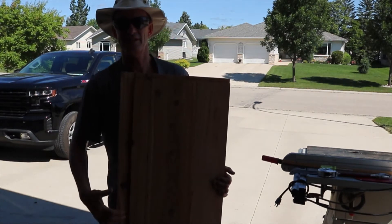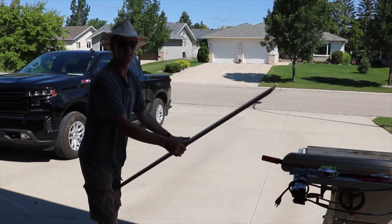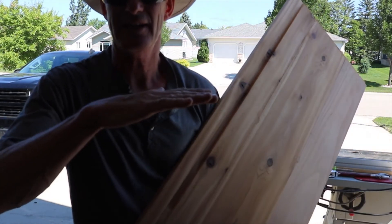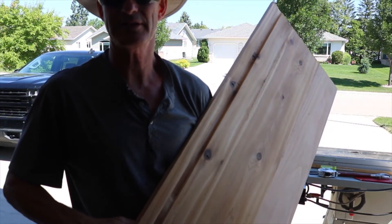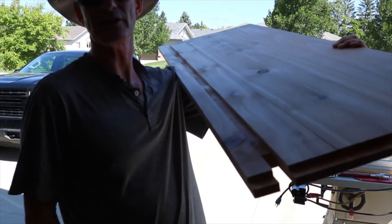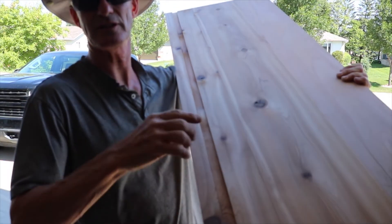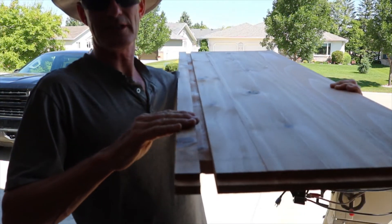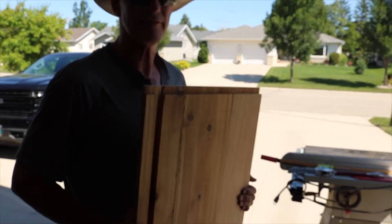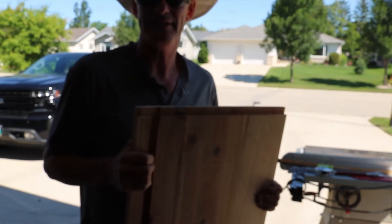I had the dado in here the long way, just like that for the shelf. But if you've used a sled and then you go to put your board right on the table, drop your blade — I'm telling you that because I learned the hard way. That will just make the counter that much shorter. Remember to drop your dado blade if you were using a sled, because it's three-quarters inch higher, and then it takes out everything.